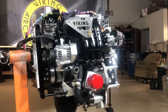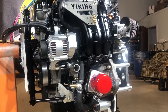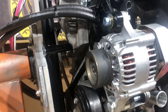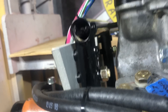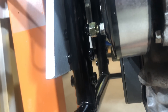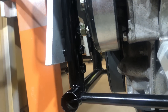A nice feature is that a cradle has been fabricated and is installed on every engine, mounted from the rear. A bed mount is also available. As you can see here, this is a 4130 steel powder-coated cradle that is bolted to the engine. Once installed at Viking, the engine arrives this way with three mounting locations on the back of the cradle. They have the same bolt pattern as the Rotax cradle, giving you three different height positions — low, medium, or high — from which to mount the engine. The four holes on the back mimic the four holes on the back of the welded cradle that comes with the latest Rotax engines.